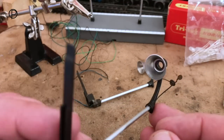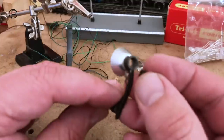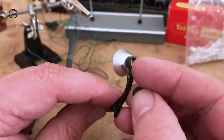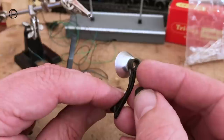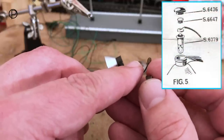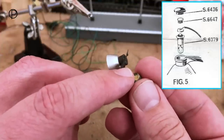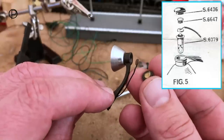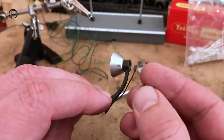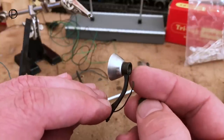Part of the work's already been done here as the bulbs have already been removed — they're quite stiff to get out sometimes. We need to run a file just around the inside to clean it up a little and give a better contact with the LED. This little metal or copper disc goes on the back of the bulb to make contact, and there's a little sponge pad which is supposed to add pressure to make the contact. It's not very reliable — I tried initially to get this contact to make contact with the foot on the back of the LED but it wasn't reliable, so I now solder the contact directly onto the LED and let the other foot contact the metal housing.